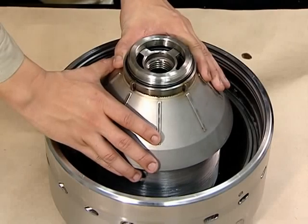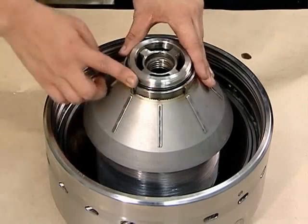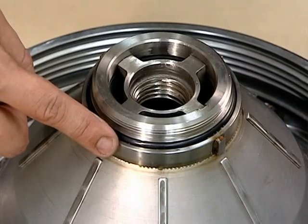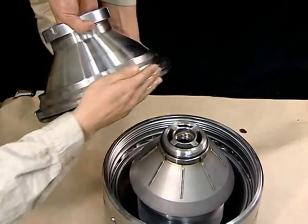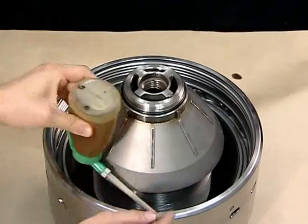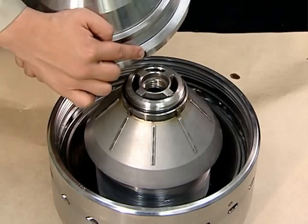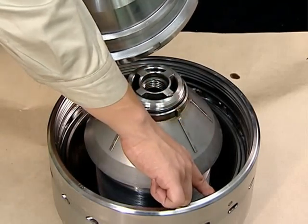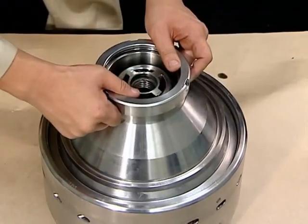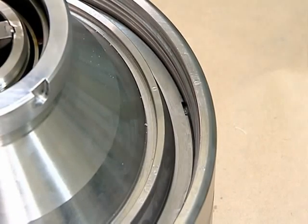As with the disc, align the top disc with the keys on the distributor. Check that the O-ring is installed on the top disc. Check that the O-ring is mounted on the bowl head. Mount the bowl head. Align the grooves on the bowl head with the notches on the bowl body for mounting. The zero mark of each notch position is indicated above the notch.